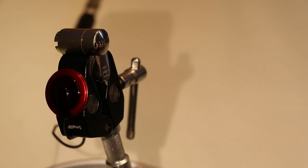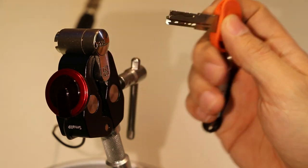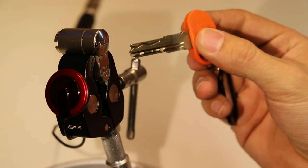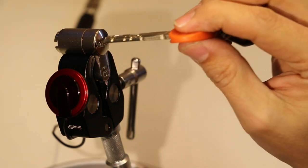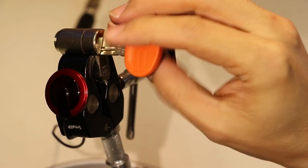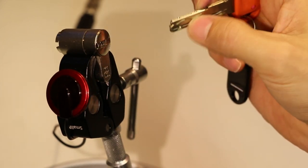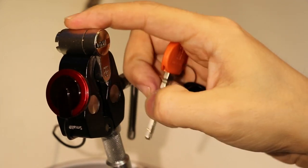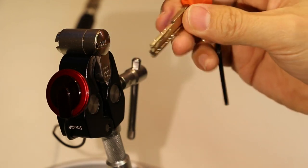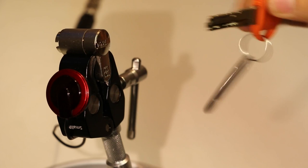Okay, here I have the Mottura Champions C43 Plus. It is a five dimple lock that has spools. It also has four rotors on the bottom that interact with a sidebar, and those rotors have false gates on them. It also has five passive pins to retain the key.